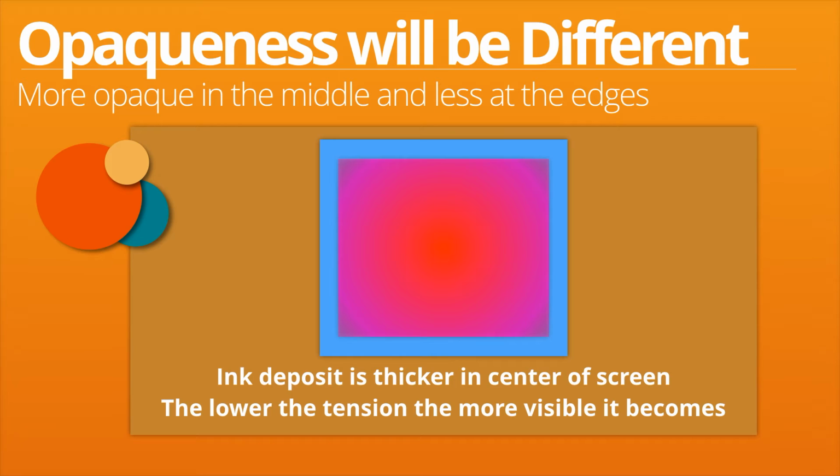Of course, most press operators will then make two passes of the squeegee to fix the problem, building up the ink deposit at twice the cost in ink and twice the cost in labor, or more if the printer chooses to flash gel the ink between the coatings. And that means more time, which means that the production for the day will be cut in half, along with the revenue produced by the shop. But wait, we're not through with the bad news for those who attempt to use low-tension mesh yet.